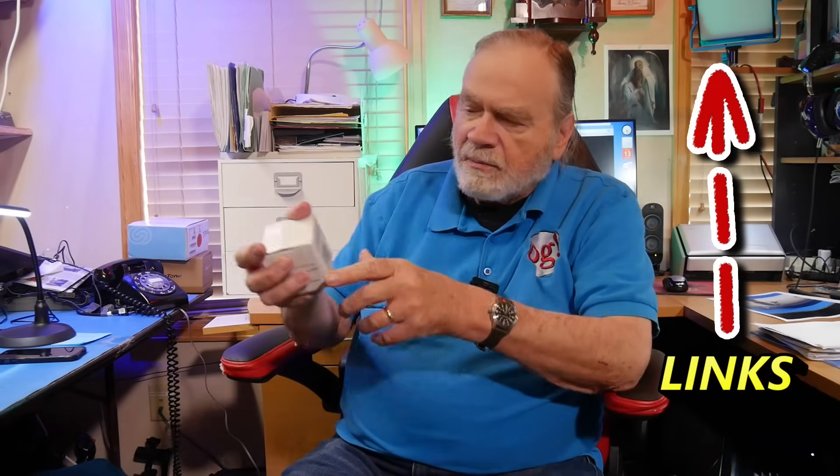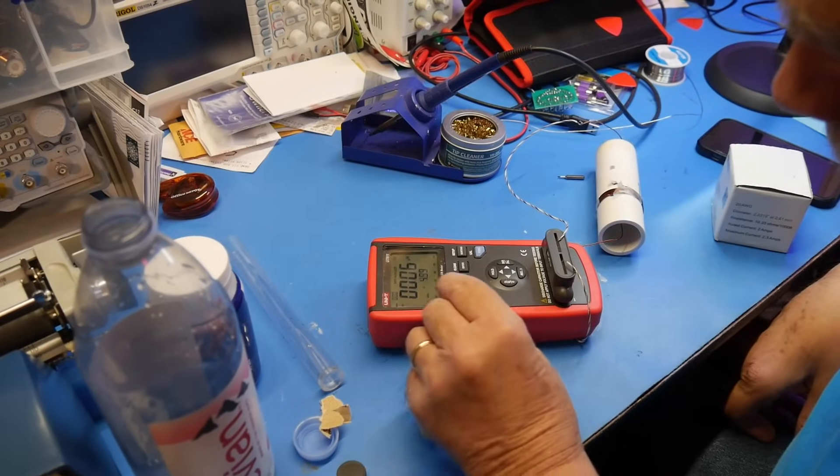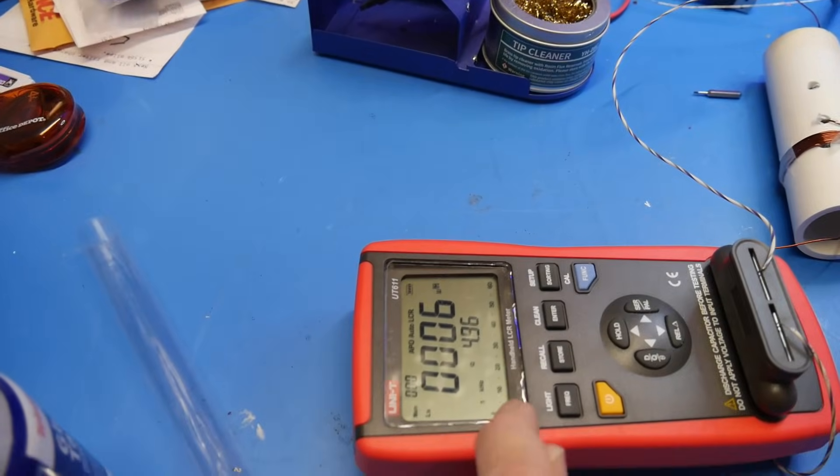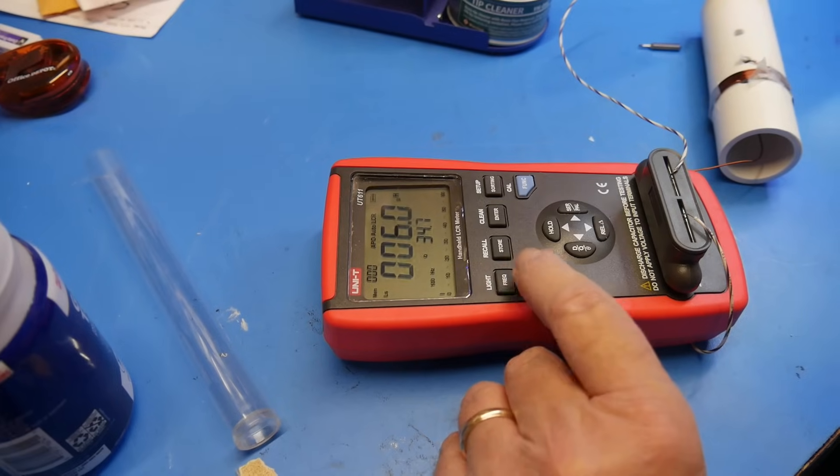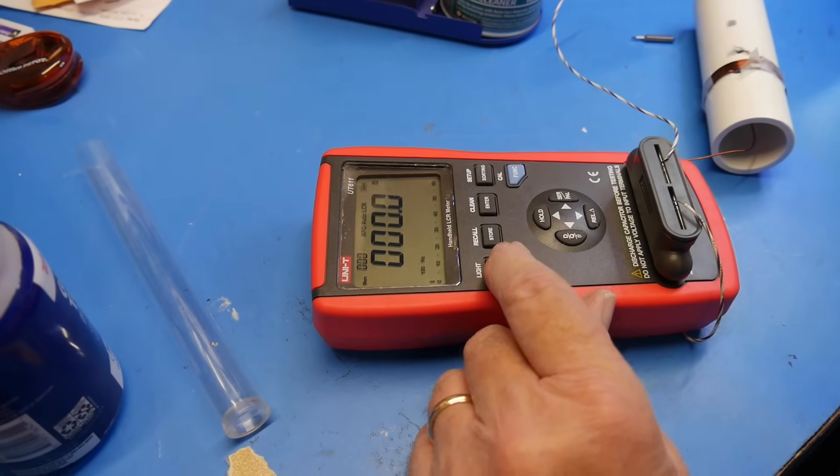This box of wire says CMS Magnetics Magnet Wire 20 AWG, so that's what we used in the formula. There's quite a bit more going on. The Q of the coil could be quite low — I'm measuring it at its highest frequency, and it's reading six microhenries. This is the Q of the coil, which is not high. We can change the frequency around — at 10 kilohertz it comes up with a much higher Q. We can even go to 100 kilohertz, but for whatever reason it's not measuring there.